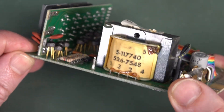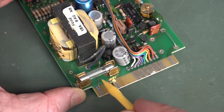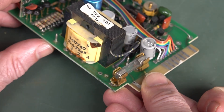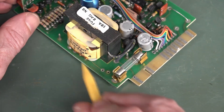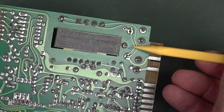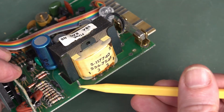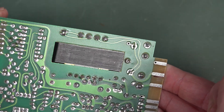You don't see construction like that anymore. So we've got mains in here. I would have thought — hook up the mains here and here. But that trace goes through there and it's connected onto the case — it's like inside one of the laminates. I assume that's an earth. And then one goes in here through a fuse over to here. There are a couple more mains wires — must be this one and the other one on the other side. That goes over to here. So this is the primary side, this is the secondary side, and they've got a tap off here going to one pin. Is that a shorted turn, or is that some sort of voltage selection, perhaps?